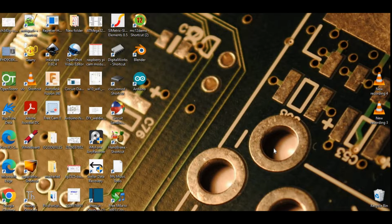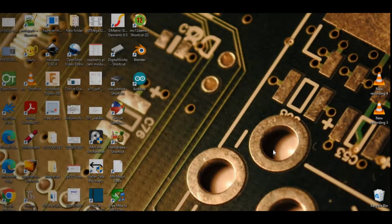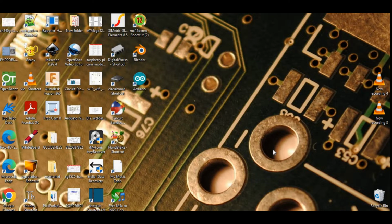Today's video is going to be really helpful to lovers of Arduino because in this video I'll be talking about and clearly troubleshooting all the problems concerning how to program Atmega64 and Atmega128 chips. As you all know, these microcontrollers are 64-pin advanced versions of MegaCore, providing lots of input-output pins, and their main advantage is their flash memory size. That is 64 KB of flash memory in Atmega64A and 128 KB of flash memory in Atmega128.